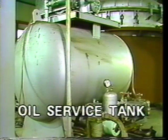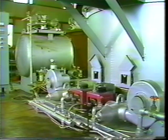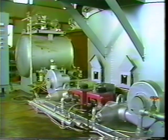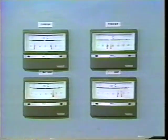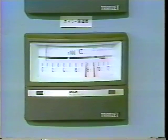Flammable gases are also usable as fuel through the use of a gas burner. To keep the maximum heat dissolution temperature within the 800 to 900 degrees centigrade range, the oil burner has an auto on-off control. After heat dissolution is completed, the burner stops automatically.